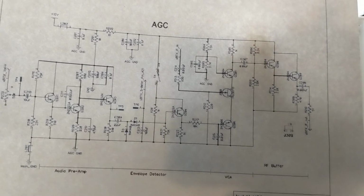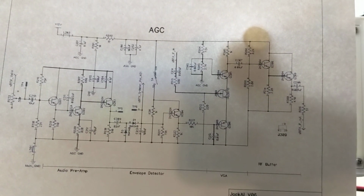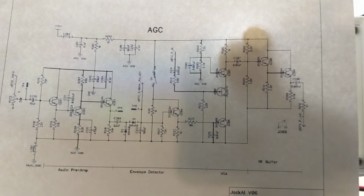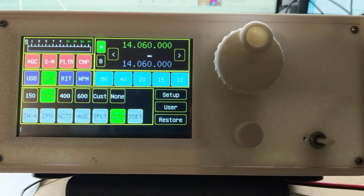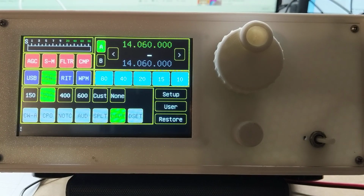I did measure the voltage at test point 6, and it didn't seem to change a whole lot, but I didn't spend a whole lot of time on that. I did put a serial print line in the code that gave me the ADC count, and it did seem to change, but not drastically. At most I was getting a couple hundred count change. So I'm not sure if there's still some issues there with the code or if it's all hardware or what.